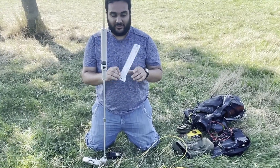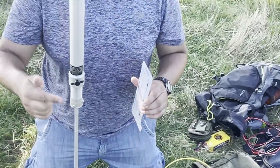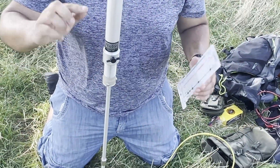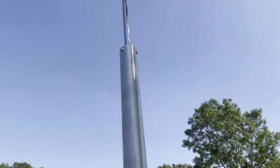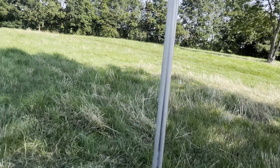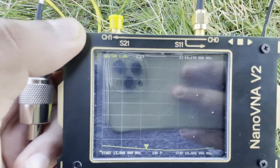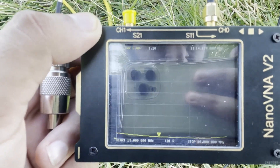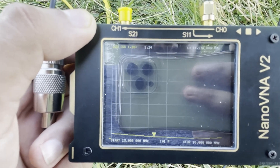Using the frequency adjust guide, I've set the Super Antenna coil to the correct height. After adjusting the Super Antenna to the correct height, the SWR on the 20 metre band is around 1.2 to 1, which is very, very acceptable.